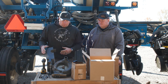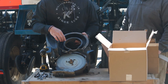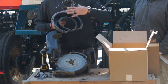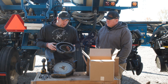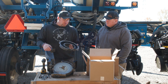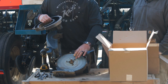The edge vac meter of course only rotates one direction. When you take your cover off, some of the unique items and wear points you need to pay attention to are the back of the vacuum housing. Our vacuum hose attaches to the housing and it's physically drawing that disc against the meter housing, creating drag and resistance. On the back side of the meter cover are little ribs — think of them like the wear indicators on car tires. If there are no ribs left, the housing and disc are worn out. As you can see, those ribs are pretty smooth — there's not much left, they're getting close to worn out.